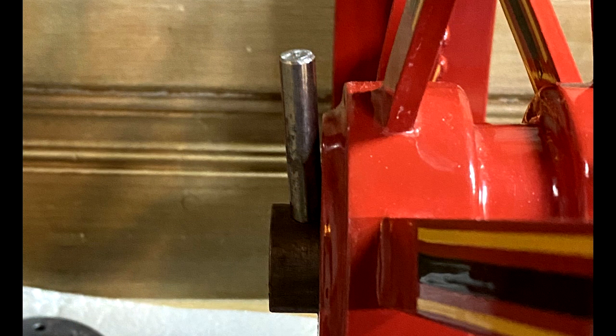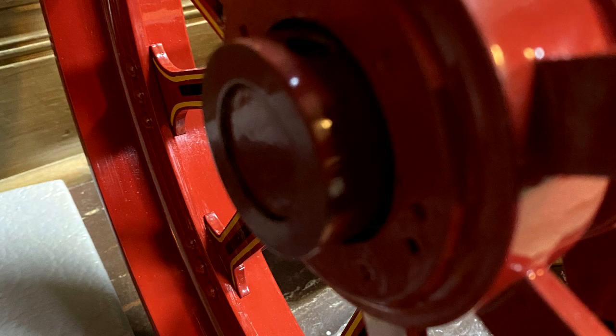During test fitting, we discovered our wheels did not sit down far enough on the axle ends to allow the retaining collars to line up with the holes on the axle. The retaining pins could not be inserted through the holes in the collar and through the axle end holes. The wheel hub bearings were fully seated in the hub, and the correct bearings were used in the correct positions when assembling the wheel. Our wheels appeared to fit fully down on the axle as far as they should, so I cannot explain our misalignment.